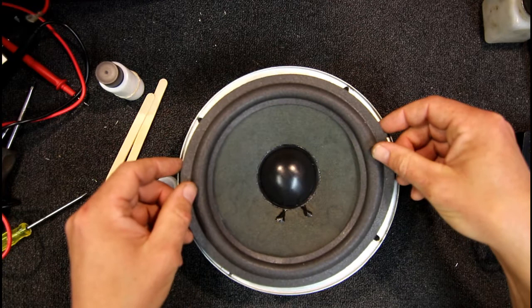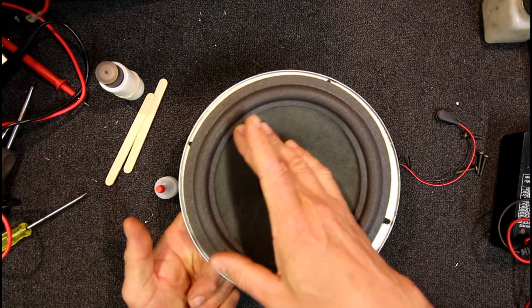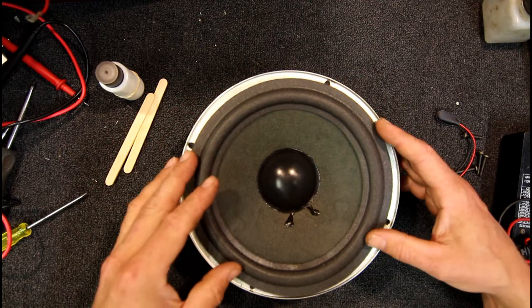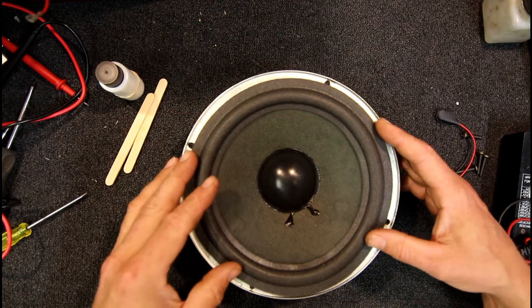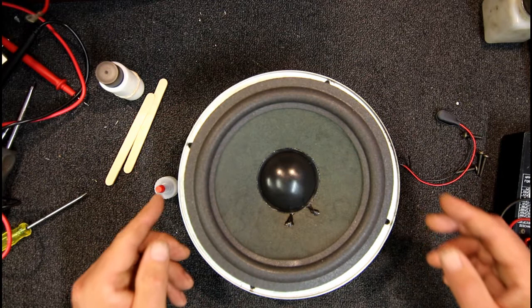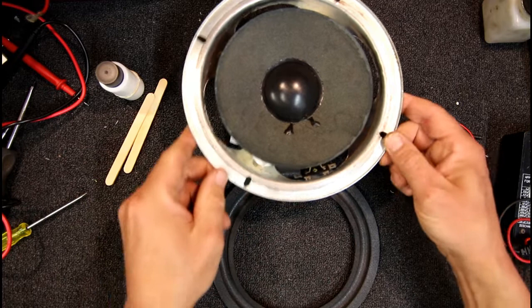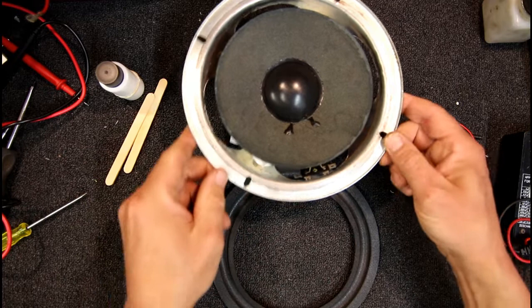I think that's what they're trying to say — it's probably best to put the paper towel right down at the bottom and just push the cone up a bit. That's got it sitting up a bit higher than usual. Not sure if it helps that much, but then basically put the glue on and press down with a finger each side — one underneath and one on top — and just hold this down. We really want to get this centered on the ring on the outside, the silver bit of metal, as much as possible, so that we know we've got it evenly on all sides. With the same gap all the way around, we should be pretty right.